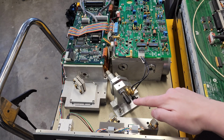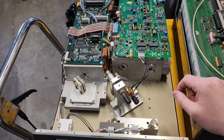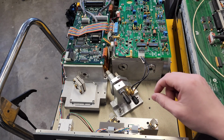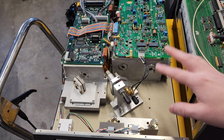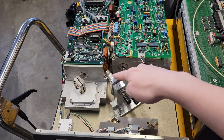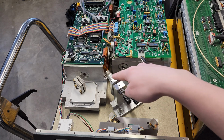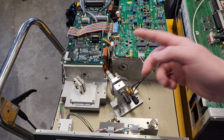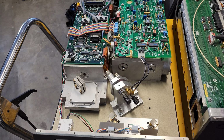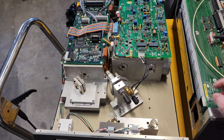But as you can see, there are manual rotation knobs on this. So in theory, you can manually tune the alignment and turn off this servo feedback automatic updating thing if these piezo drives fail. Talking to some people in the industry, they suggested that I check the piezo drives to see, hey, is it the piezos that have a problem maintaining the alignment? If these piezos are dead, then this is a pretty easy fix.